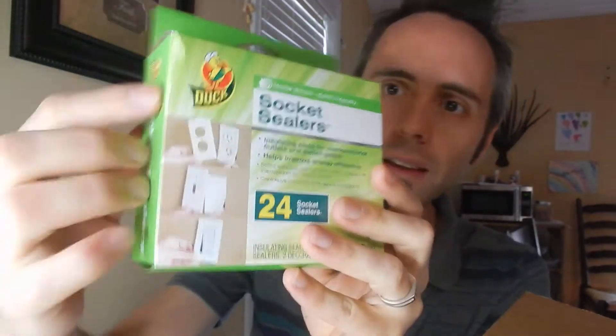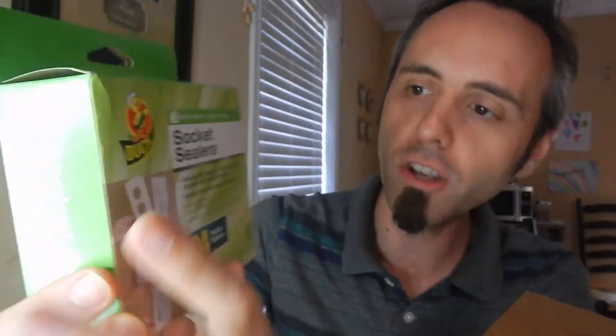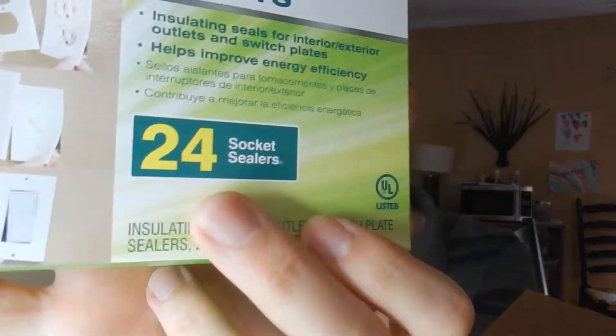One day I had a home energy audit done on my house where they put a blower fan on your door and then they test the pressure. Whenever we were going around the house after they had the fan turned on, at every outlet and wall switch and little tiny things that are cut into the wall, you could feel just a little bit of air coming through there. The guy that did my energy audit told me they make insulators for wall sockets in particular. So I found these made by Duck — I'll link it up in the description below. They're made by the guys who make duct tape, and it's basically like a little foam board. You could probably get a piece of foam and an exacto knife and cut them out yourself, but this was fairly inexpensive and an easy way to get 24 coverings, so I thought that was worth the money.